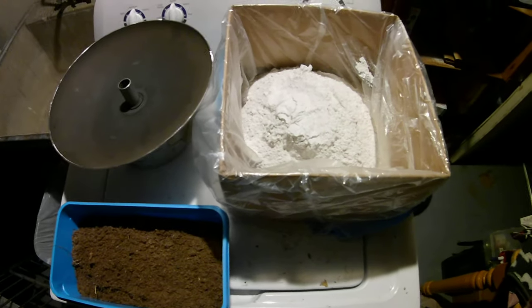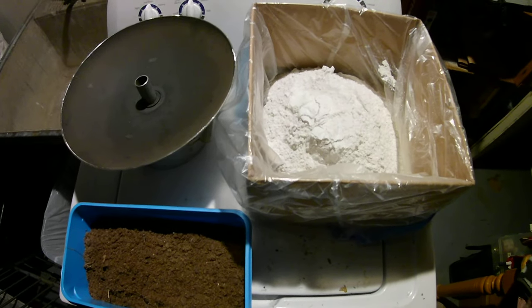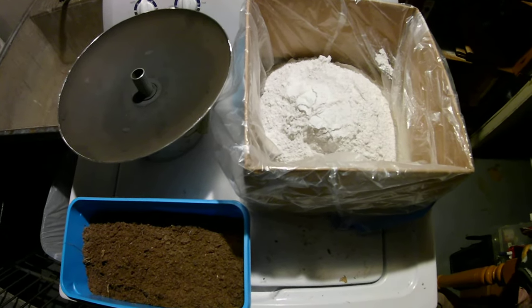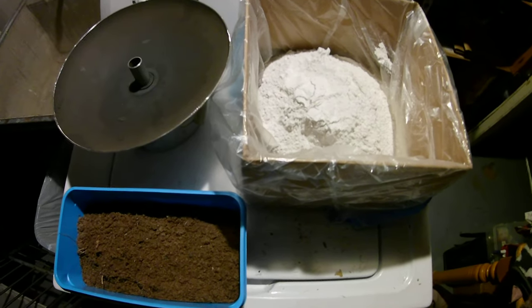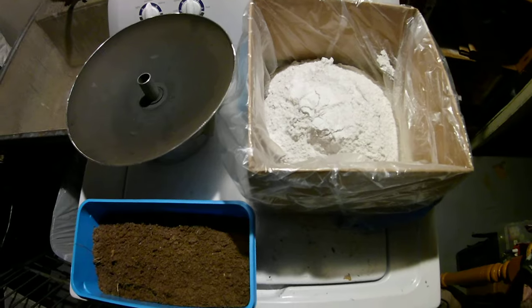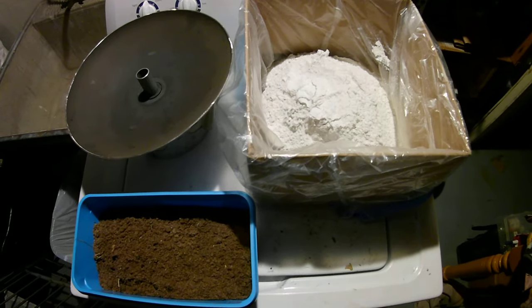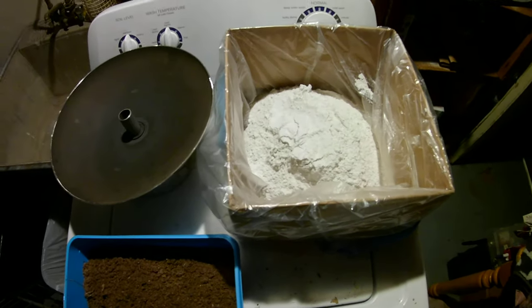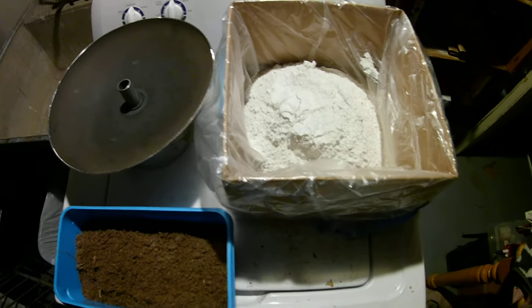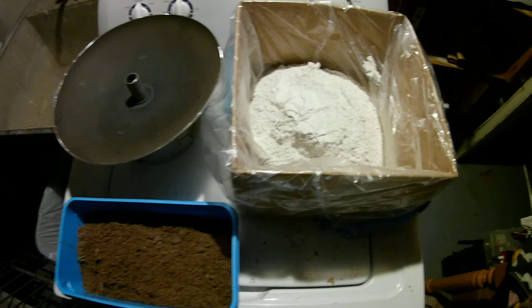Let it set up for probably 72 hours before you actually fire it. You can quick cure it, but you've got to slow cure it — really slow temperature, bring it up. You could do it in your stove, but do it really slow. Maybe start at about 150 degrees and every four hours jump it up another 25 degrees, because you don't want it to crack. The thicker it is, the longer it's going to take to set, and there you go.